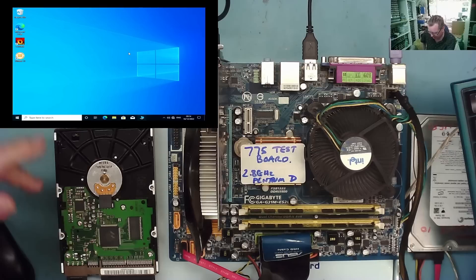You'll find this is quite common. All you need to do is remove the shorted TVS or Zener diode and copy all your data away. Or as I said, put another one on from another hard drive — a scrap one or just one you don't need anymore. Short one, hope you liked it anyway, something else maybe you've learnt. I'll see you all soon on another Electrons Repair video. Ciao for now guys.